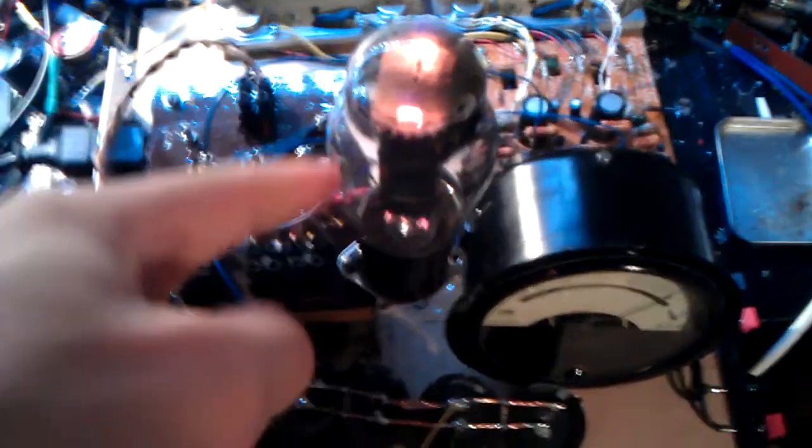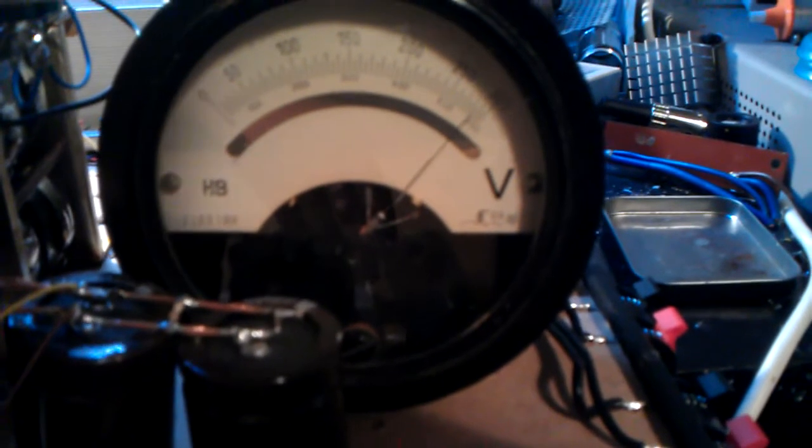This is just a very crude prototype, and we got a 5C3 rectifier tube here, glowing pretty well actually. It's a full wave rectifier, using a transformer here, feeding it heater voltage and plus minus 50 volts in center taps, and that gives, now let's see, no, that's not right at all actually, it's about 80 volts ish. And 80 volts is pretty good, it's much better than 49.